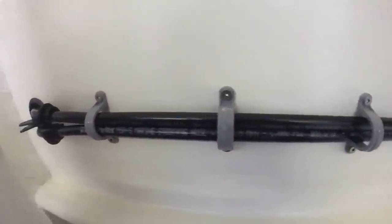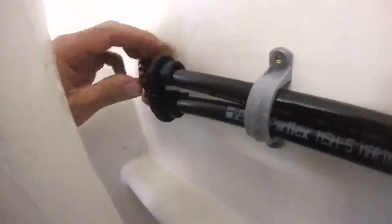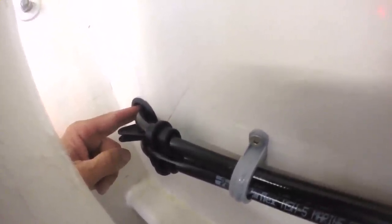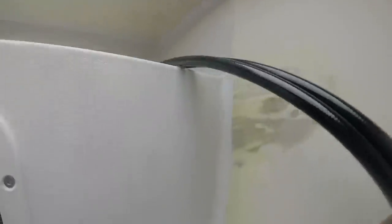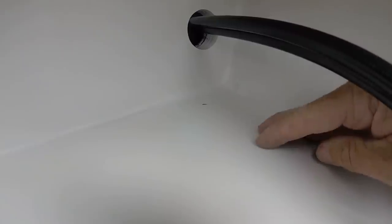Here are the hydraulic lines coming through the back of the master closet. I have to make a hard 90-degree corner here, but I picked up these 90-degree supports that keep the hose from kinking — looks like it does a pretty good job. Let's dive back into the sugar scoop and make the connections on the other side. Kind of a blustery day here on Lake Union — wind's picked up, boat's moving a little. Before I can make the last connection, I need to drill a hole down through here and put a watertight fitting around it. This is a crash compartment, so I don't want water getting in. There's also a wet locker, so when I drill through here, I'll need another watertight connection there.